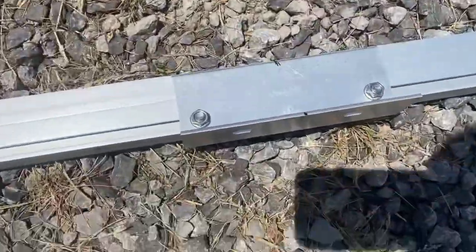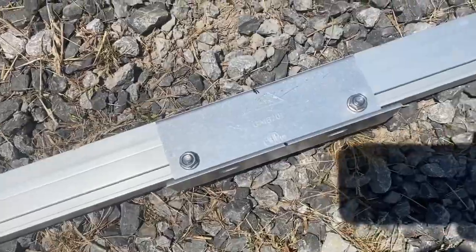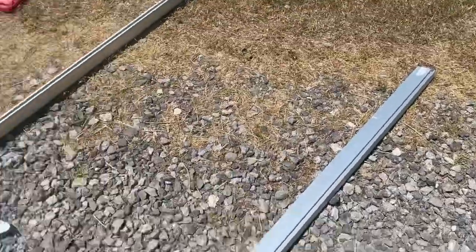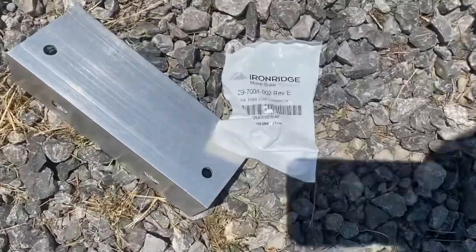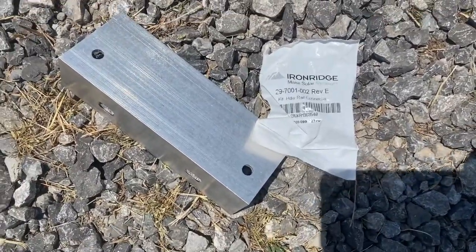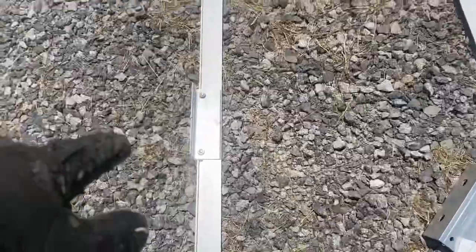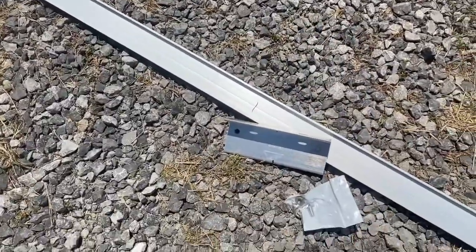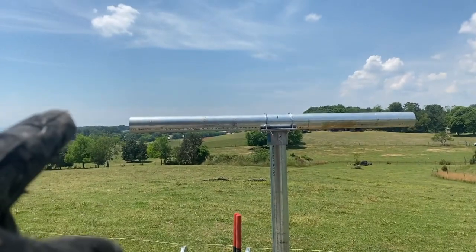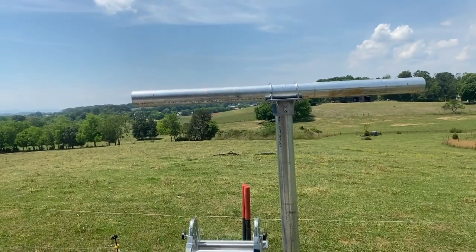At this portion of the build you have the GMB 201 bracket. The guys at Hurricane Wind Power can help you design your top-of-pole mount arrays — this has already been cut to length and shipped to me for these three modules. You'll take these bolts, part number 29-7001-002 hardware rail connection kit, run those square-head bolts down the channel, then lay the bracket on centered on the rail. Mark a center mount on your bracket to keep it steady and straight, then center it up, tighten it down, and that will set on top of the pipe. I come in about five inches so the panel has some inset and can flex in the wind.